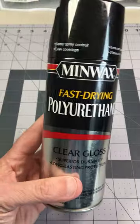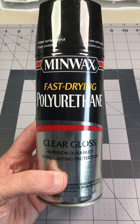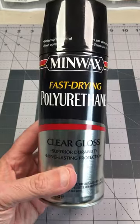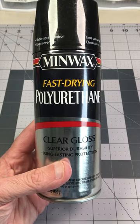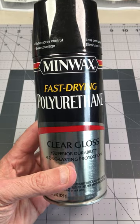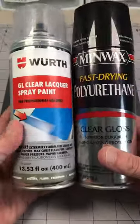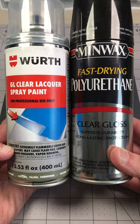For another choice, I've been using the Minwax Fast Dry Poly prior to that, and I was really successful with that. It's also available in a satin and a semi-gloss. The problem with this poly is it will yellow slightly when it dries, so obviously you can't use this on a white, and depending upon the color you might not want to choose it — but it works very well too. Those are the ones I'm currently using for a gloss clear.